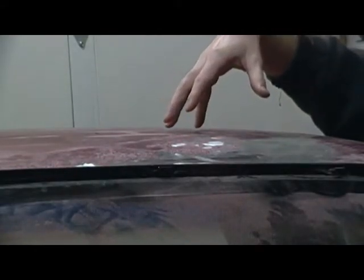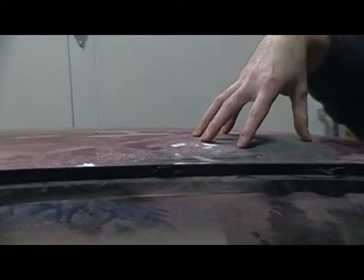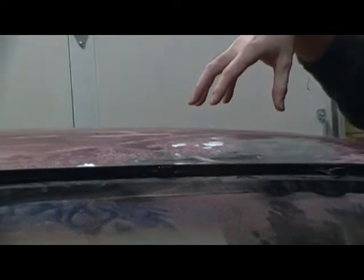If I was going to leave it outside, I'd do the etching paint and a two-part sealer, or just a two-part sealer on bare metal, whatever the case would be. So with this, I just need to get it stripped off, get some etching primer on it, and get it cleaned with acetone so there's no fingerprints in that. And then it should keep for another year. It looks like it has chicken pox for the paint, but...